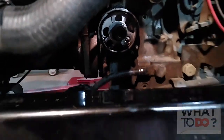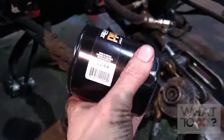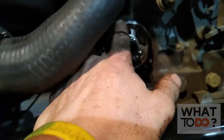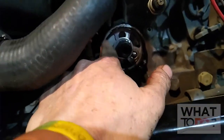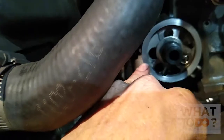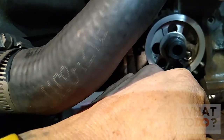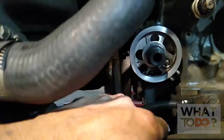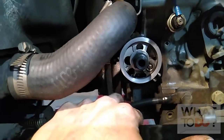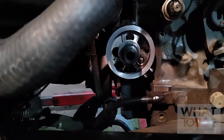We only had a couple drops come down — wasn't as bad as I thought. Be careful here because you don't want any debris getting back inside the motor. You definitely want to clean all this up before you put your new filter back on. Get a rag and wipe it all down nice and neat. Even one little spot and that new seal is not going to seat right — that's where you get your little tiny leak dripping out. This being a fairway mower for a golf course, you definitely do not want any liquids dripping down onto the turf. Nice and clean — let's get the new filter ready to put on.